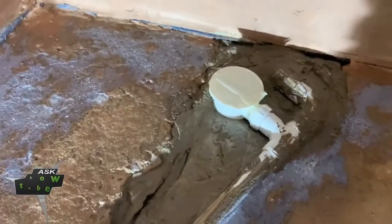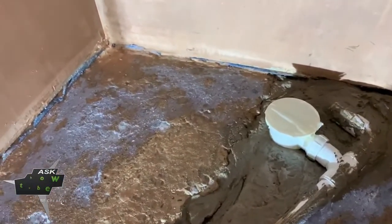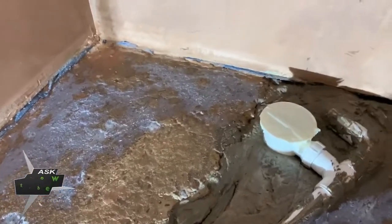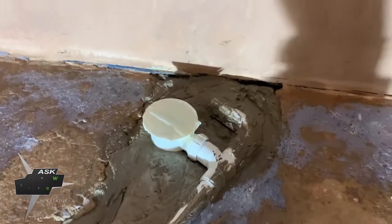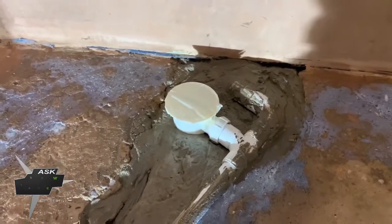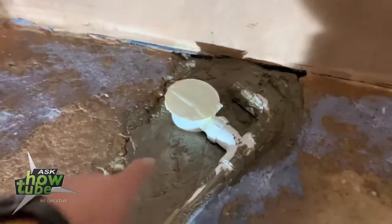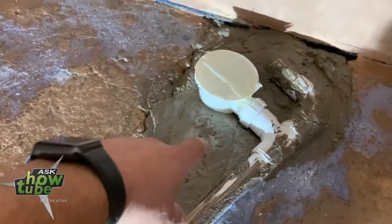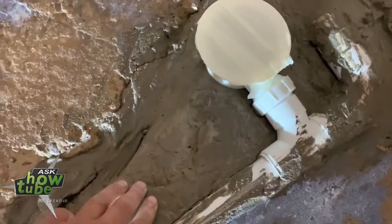I used some wood on the sides at the level I will do the concrete. I put the shower tray and I tested the shower waste bottle is in the right place. I took the shower tray out again. I put wet concrete around, very wet with a lot of cement.